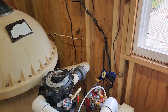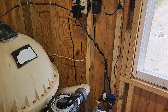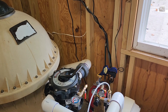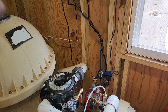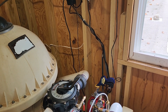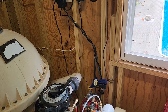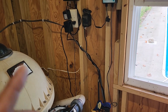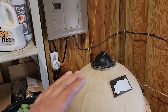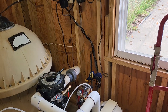One piece of advice if you're going to build something like this: run it during the daytime and keep an eye on it at first. The first couple of days I just let it run and realized the pressure difference between 1,500-plus pounds in a CO2 tank being brought down to 10 to 15 pounds creates a chilling effect — the regulator got frozen a couple of times. So now I turn it on in the morning and off before bed. Eventually I'll put it on a timer so it kicks in first thing in the morning and cuts off in the evening, when it's warmer and won't freeze over.